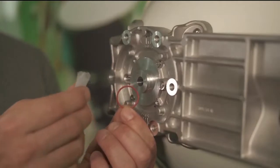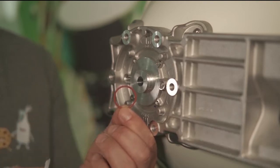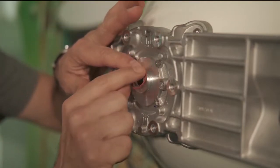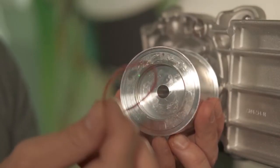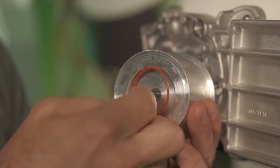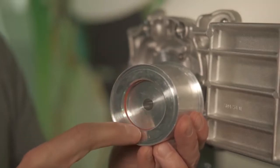The first step is to take the o-ring and the silicone grease which comes with the antenna, and we're going to put a little bit of silicone grease on those o-rings. I've already done that on this one so we're not going to duplicate it. Once the silicone is on there, there's a slot on the waveguide assembly here. We're going to make sure this o-ring goes in and seats itself all the way in that slot. Next, take your medium-sized o-ring, put some silicone grease on it — which I've already done — and put it on the inner slot in the waveguide assembly, making sure it goes in that groove all the way around.